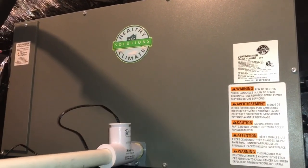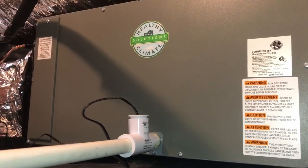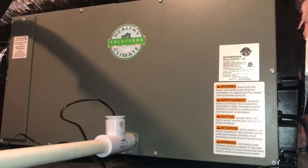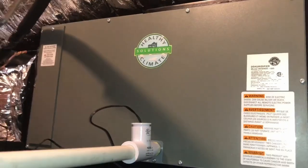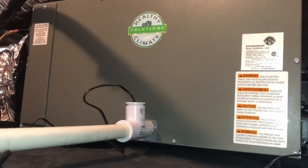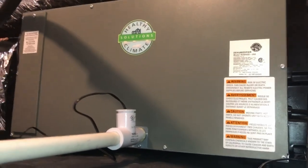So originally, he has a first generation Nest, which does not support anything other than heating, cooling, and fan. So we had to get a third generation, which does support additional equipment. But when we put it in, it wasn't working right. So we put in the old one, it worked fine. Jumped everything, worked fine. So thought initially it was a faulty thermostat, a defective one.